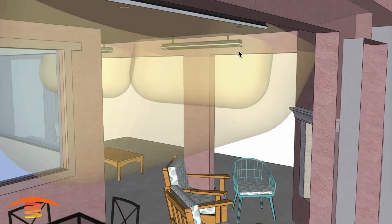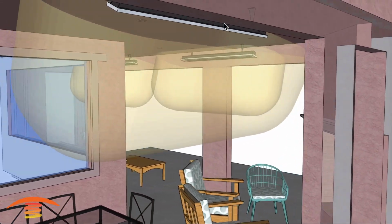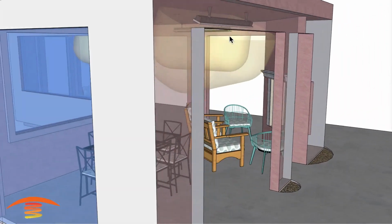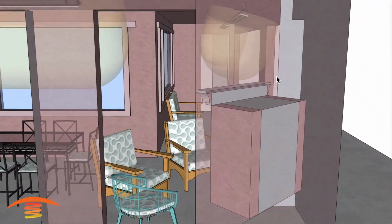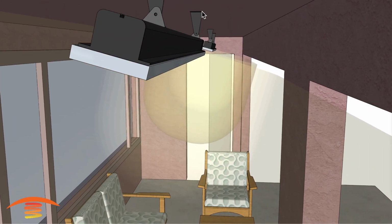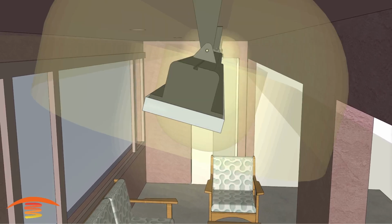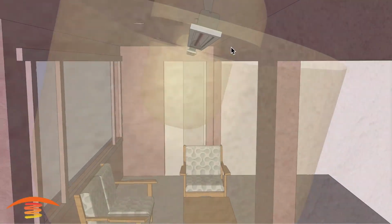So below the heater meaning that it's 18 inches on the left, 18 inches on the right, 18 inches on this edge, and 18 inches on this edge, as well as 36 inches down below the heater. So that is maintaining that clearance, not an issue. As well as over here, you can see that we are maintaining the clearances again from this edge to the wall, 18 inches, and the OEM brackets maintain that 6 inches of clearance above the heater itself. So that's one thing to consider.